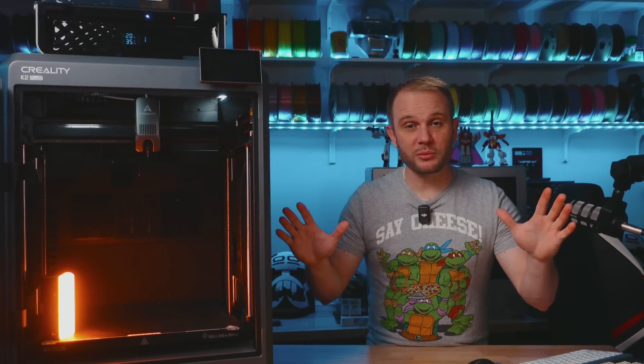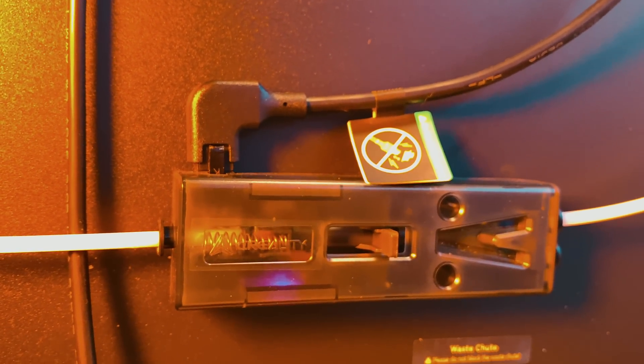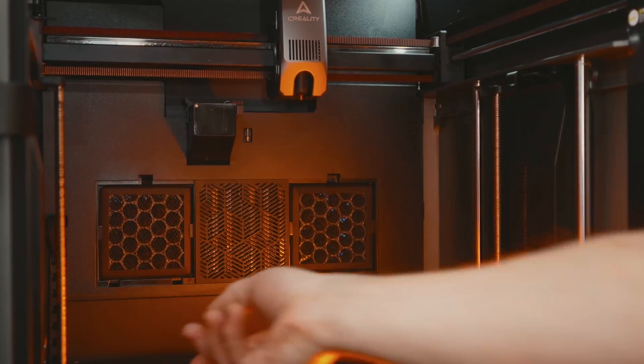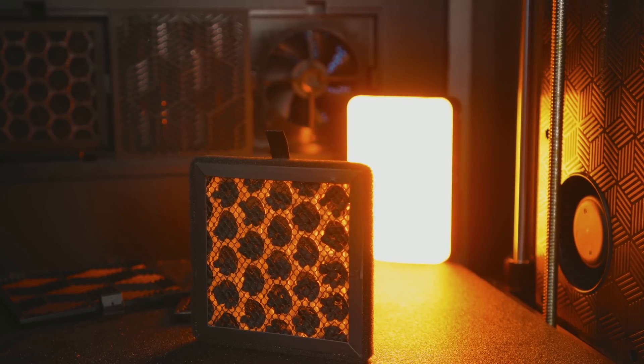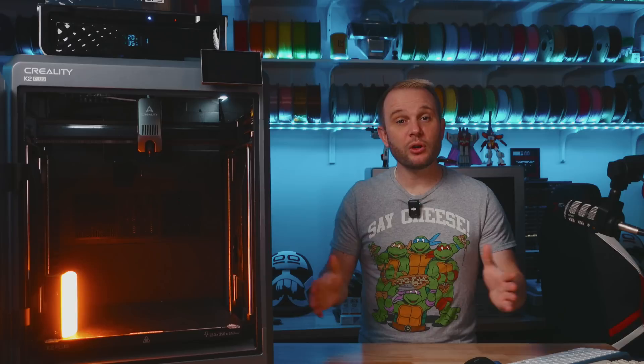In addition to all the other awesomeness on this machine, I'm stoked to see that Creality has included a filament tangle sensor on the K2 Plus. This essentially measures the amount of strain or resistance on the extruder when feeding filament. Should a tangle happen, we don't lose our prints or damage the printer — it simply pauses and informs us of the issue, allowing us to resolve it and then continue printing. The K2 Plus also has a basic set of air purifiers. It's not going to filter out harmful or toxic fumes from more advanced filaments, but it will help reduce some odors from basic filaments. For health and safety, I really recommend venting outdoors or printing in a well-ventilated area when working with more advanced filaments.